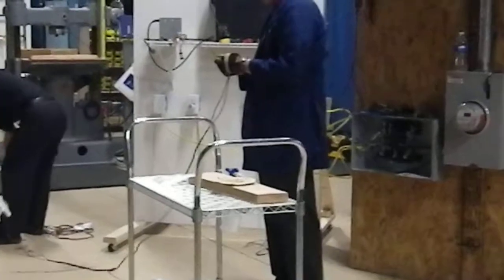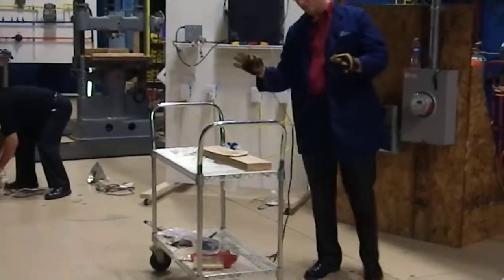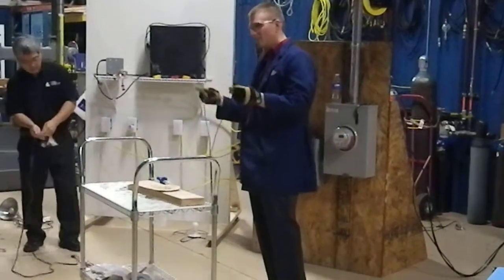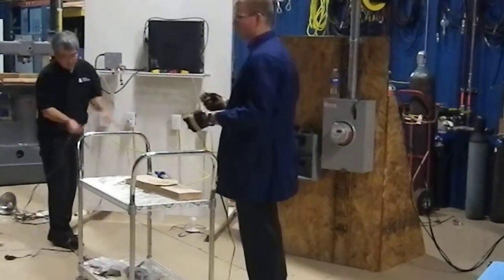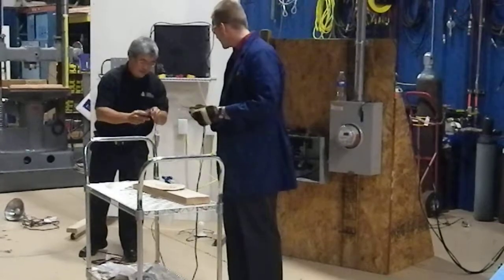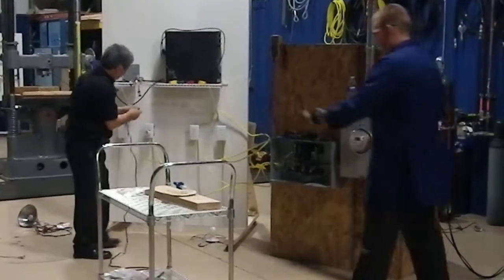Before I plug that in, I think you should notice that we have gone right through the wire. I'm going to change. This is a nice demonstration of an overload — we heated up the insulation so much because we're passing such high currents. These zip cords are rated for 10 amps. We've got a 50-amp breaker and we're definitely passing more than that when we're rattling stuff. That's probably because we've got such high resistance through all these cables.